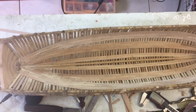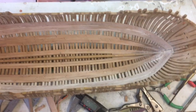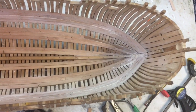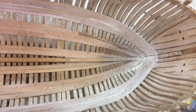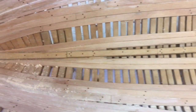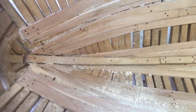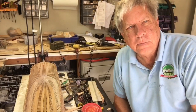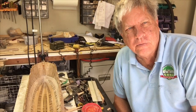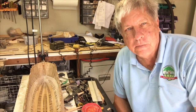As can be seen, it's really coming along quite nicely. The bow, which was one of the more problematic areas, really came as per plan. It's really just here at the back where the planks got very close to one another. Just some more cleanup, and once I'm happy with the finish I'll put on some wipe-on poly to seal and we'll go from there.